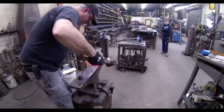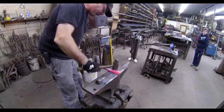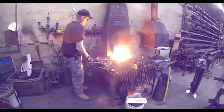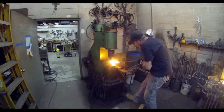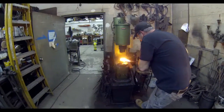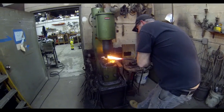This is going to be the first bend. We started out with four layers of steel, and once this is hammer welded it's going to end up with eight layers. Whenever it loses its temperature it goes back into the forge. You see a lot of sparks coming out of the hammering machine — that happens whenever there's an air space between the layers. Once the material gets fused or welded together, those sparks reduce greatly.